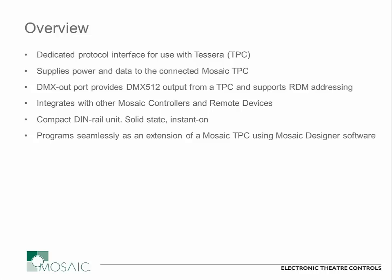The most important of those is going to be the DMX512 output. Since Tessera is powered using PoE, or Power over Ethernet, and that is the only connection made to the unit via that Ethernet cable, getting to a hardline DMX connection previously required a network switch and a gateway of some sort to convert from an Ethernet protocol — like streaming ACN, ArtNet, or the Kinet protocol from Color Kinetics — to DMX itself, so that you could connect to a fixture designed for DMX. And this is going to simplify that quite a bit.